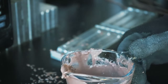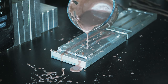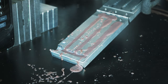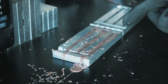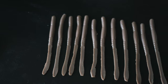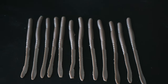This is going to be the last pour of my brown bottoms. I noticed something off camera that I think would help you guys: I'm going to lift the mold up from the back, which kind of lets everything run down the mold and gives it a much better, more even shape. It fills up any of the extra little spots in the mold and gives it a little divot where there's going to be more space for those other two laminate colors to really connect to these worms. So there you have it — we got our 12 brown bottom colors for our worms. Now we're going to lay these back inside the mold and get our blue and red color ready to go for some good triple color laminate worms.